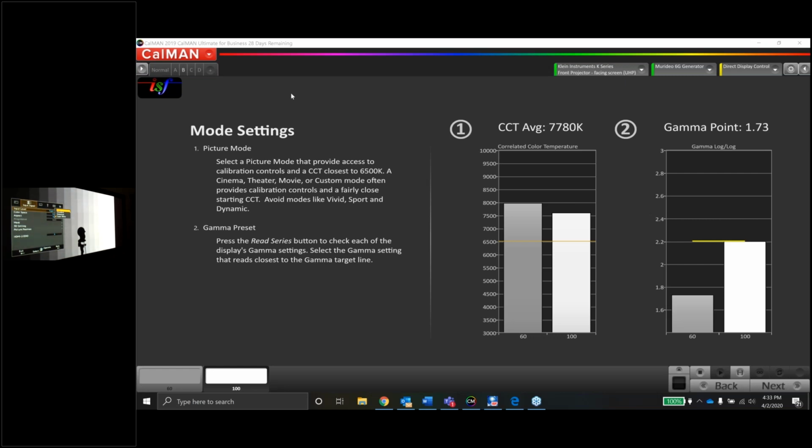Okay, so standard is legal video range. That means black at digital 16 and white at digital 235, and they're not preserving anything over white. This is where I diverge from the ISF and THX: with projectors, unlike flat panels, you don't have contrast and light to waste. Anything over 235 is technically not supposed to be there in the first place. That's an over range thing. So with projectors, I would recommend that you use standard versus super white, because anything that's going to be clipped would have been clipped in a legal video range anyway.